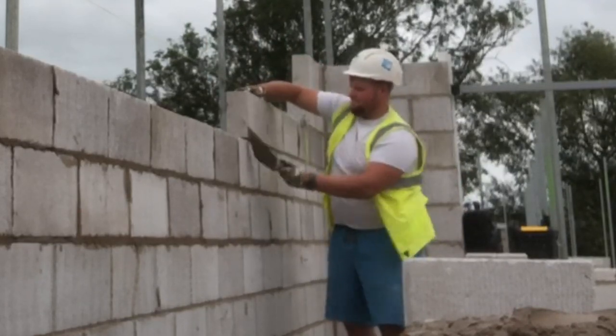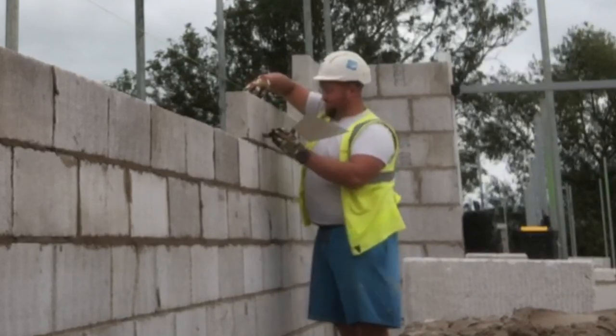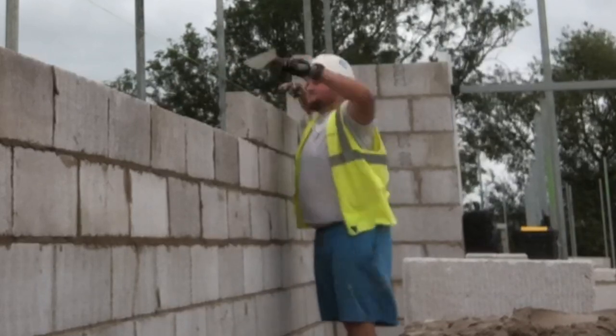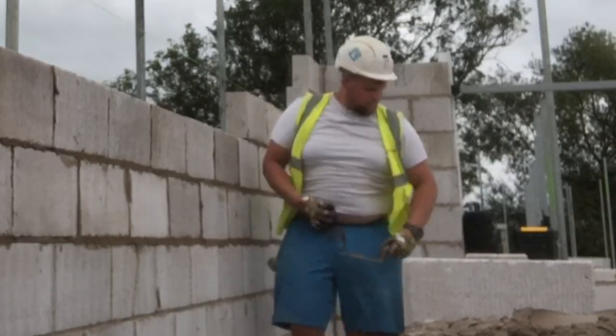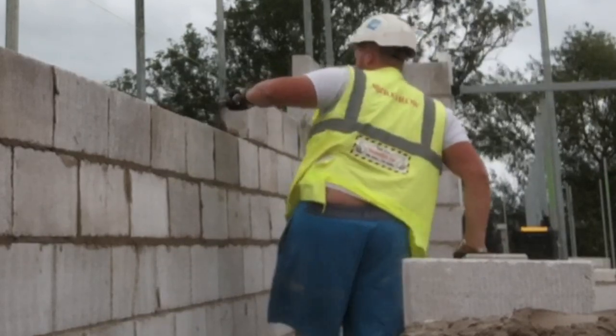So I had that top tie, a brick trapped over that top tie, tying in that last 2 course of block. That's showing over the top is tied in, and I've only got one course of ties to go all the way through under the top block, and that just gives it a bit of stability on these top lifts.